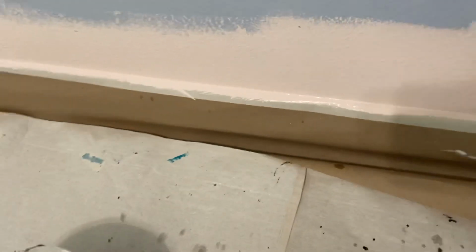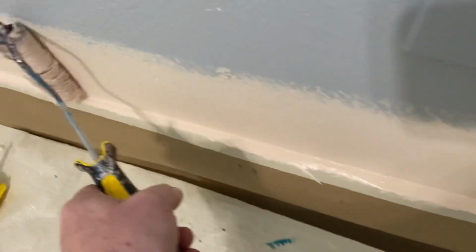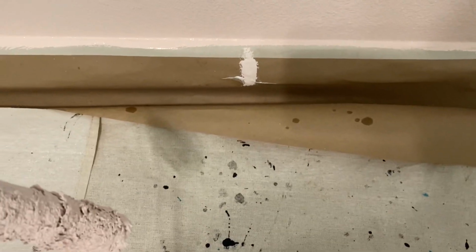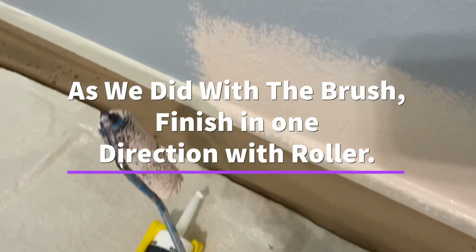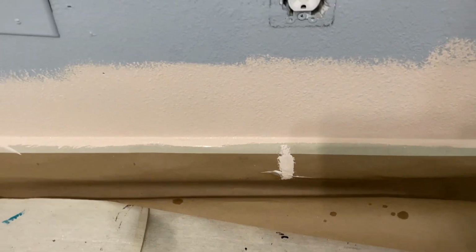And now, I simply take my roller, and I finish it off like this. You go this way. There you go. And you do the same thing. You lift off like an airplane, look. And if you want to remember where you left off, you just make a mark like that. And over here, you want to remember where you have to do your lift off and your overlap, okay?